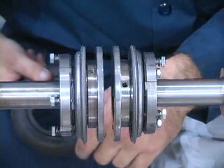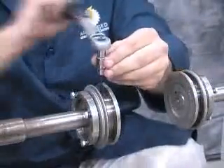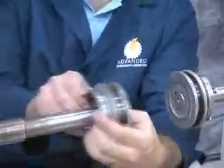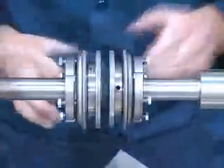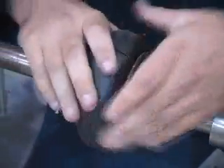If the element is being replaced, it is good practice to clean the clamp rings with a solvent and dry them prior to installing a new element. If you wanted to completely remove the finished bore coupling, at this point you would loosen both set screws on the flange — one over the key and the other at 65 degrees on the shaft — and slide the flange off of the shaft. For element replacement, you do not need to loosen the set screws. Simply wrap the new element around the flanges and seat it in between the clamp rings and complete installation as previously instructed.